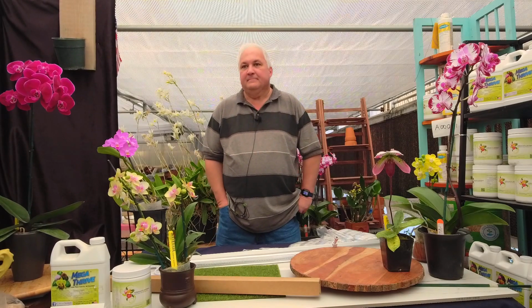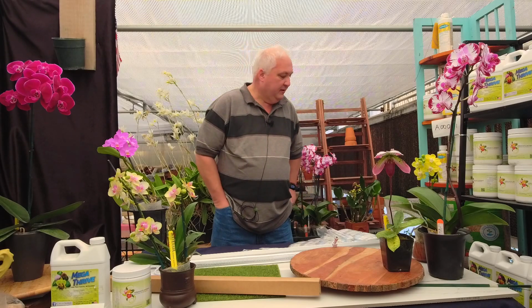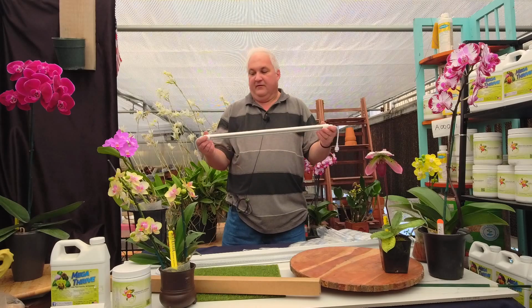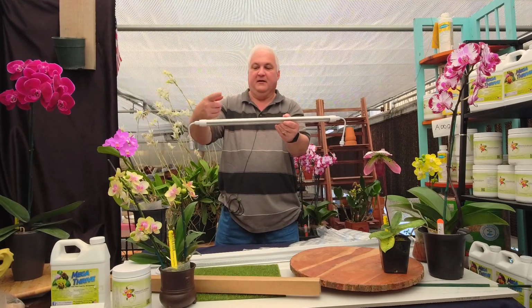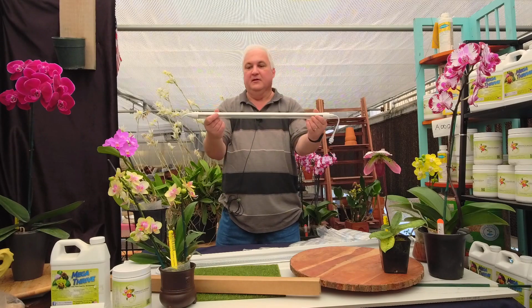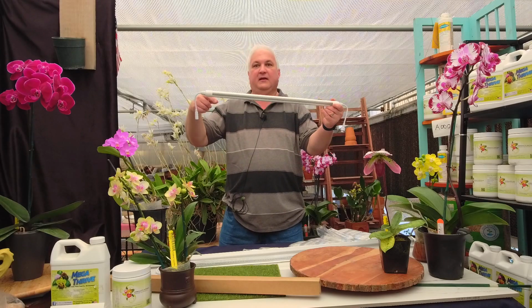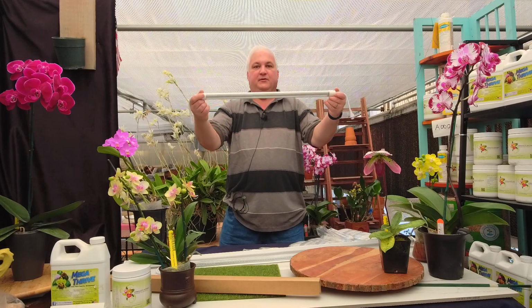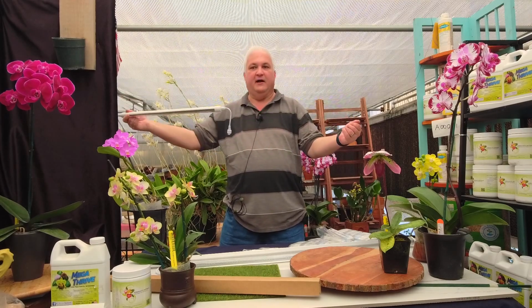So there's several questions about how do you hang the lights? Okay. I didn't even bring any of my hangers, but for me personally, what I like to do is a zip tie around here and a zip tie around there. So 2 zip ties will hold even up to the 48-inch LED. And then I leave a loop. I don't run them tight. I don't cinch up the zip tie. I leave it loose, and so it just sits there. And then if I ever want to slide the light out, I can just slide it out through the loops.